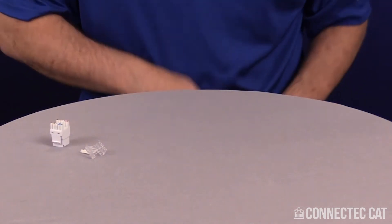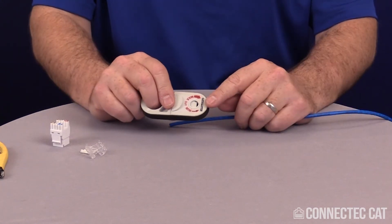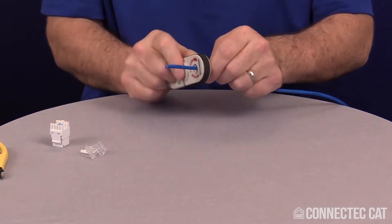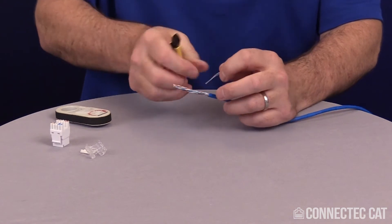The first process is going to be to prepare your cable — Category 5E UTP cable. Using a cigar cutter style stripper, I'm going to strip about two inches. I'm going to use the minimum spin so I don't cut too deep. I'm going to pull the ripcord off to one side and trim it — don't need that.